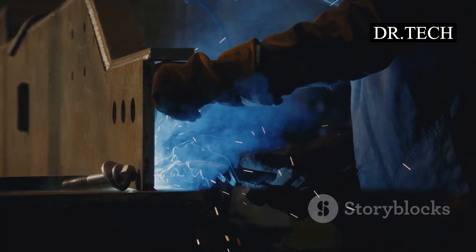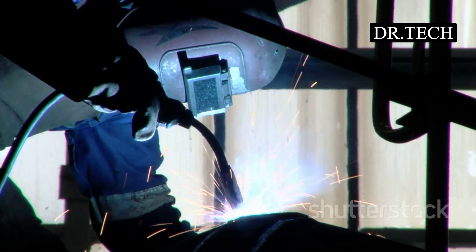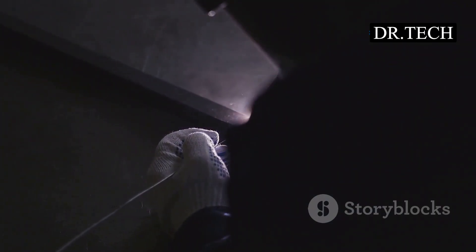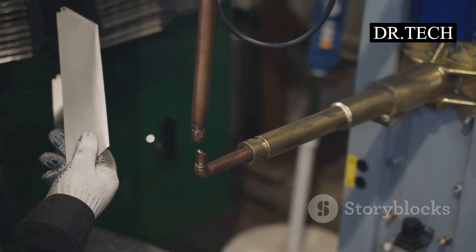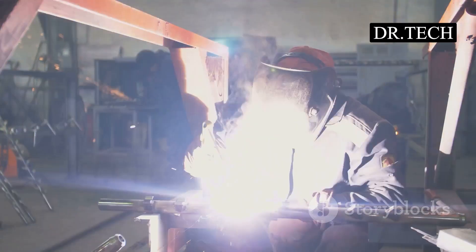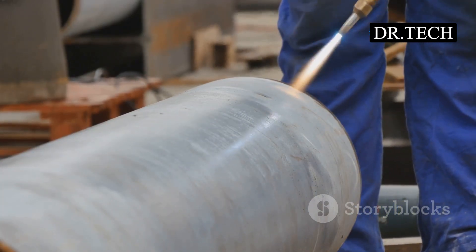The cleaner the metal, the better the electrical connection — and the better the connection, the better the heat, and the stronger the weld. It all links together, so take your time here. Once your metal is clean, you need to line it up. The spot weld joins the metal where the electrodes press, so you need that spot to be exactly where you want the join. Overlap the sheets — the amount depends on the job. Use clamps if needed. Good alignment means strong, consistent welds. Clean your metal, line it up right — then and only then are you ready.